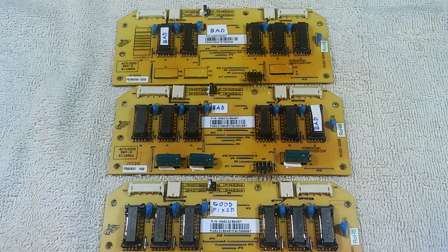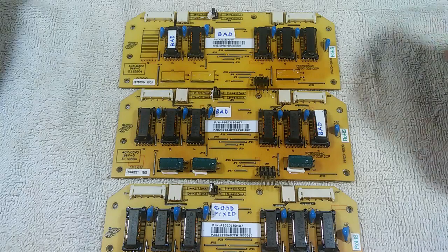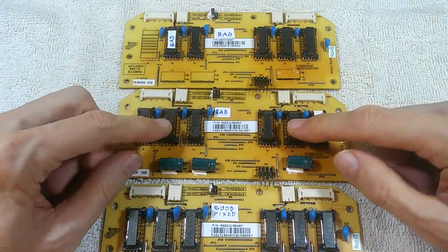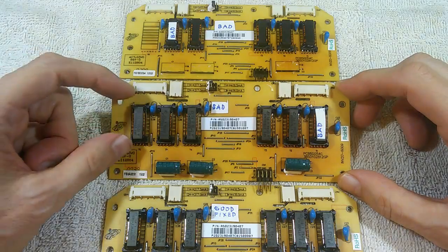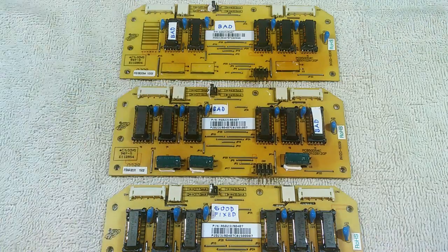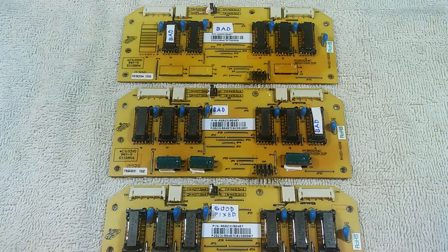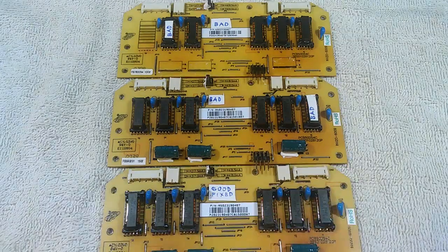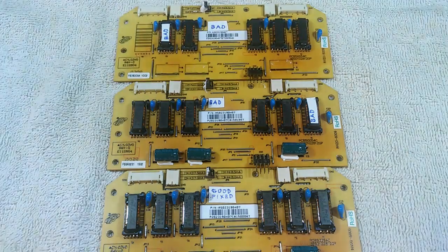In summary, we went over the technology of CCFL backlights and the inverters that drive them. One of the failures they suffer is open-circuit transformers on the inverter board, and we went over how to troubleshoot those by looking for an open circuit. Whatever monitor you're working on, your inverter might have a different part number — maybe something you can find and purchase — or perhaps you have a couple of monitors and can sacrifice one inverter board for parts. If you're having a backlight problem, perhaps the best long-run solution is to replace the backlights altogether with LEDs, though that requires taking the entire monitor apart and is much more work. If you just want to replace or fix an inverter board, that's a much easier fix. Thanks for watching.